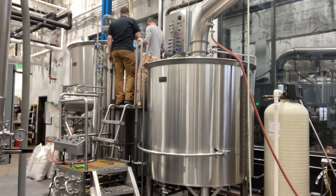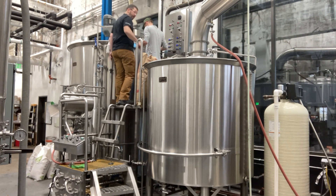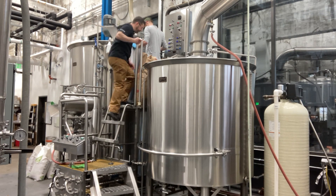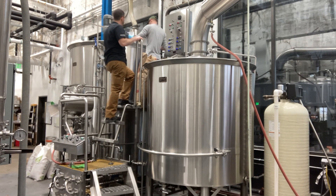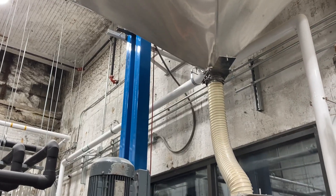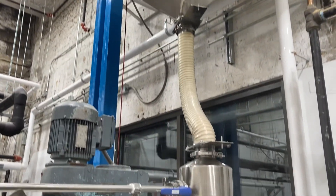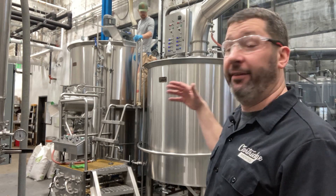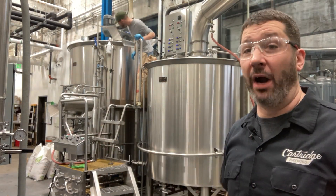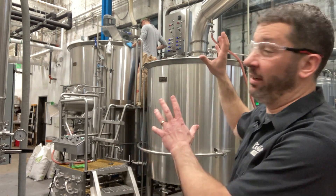That looks great — a great thickness for what we're looking at. We're going to be pulling 513 gallons for this portion. Remember from last time, we'll be spreading these over the top as we go. The grist hopper up there is a large vessel that holds all the grain we're dropping into the mash tun — you can put too much in it. So for beers like this with a good amount of grain, we leave some bags of grain to be milled while we're actively mashing in, so we don't have an issue overfilling the grist case up there.